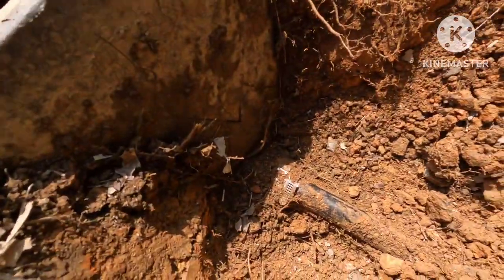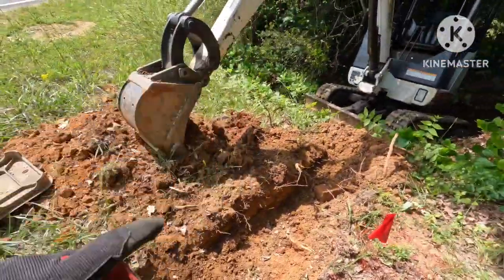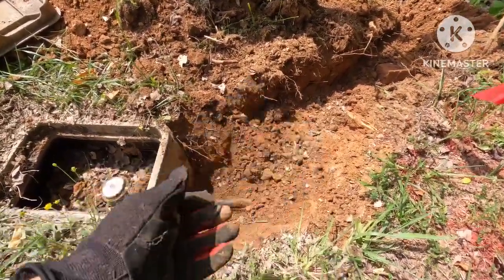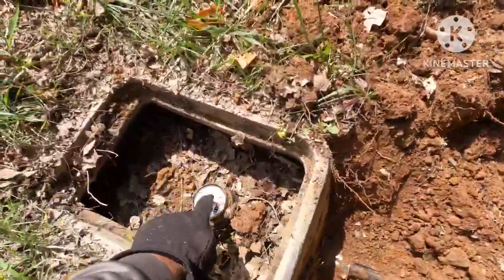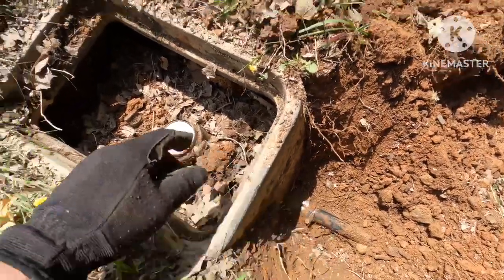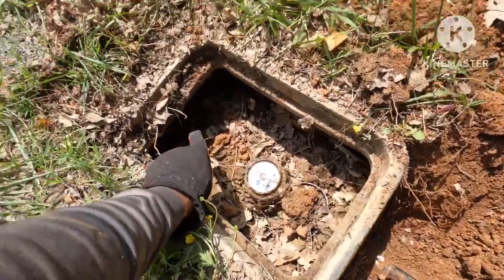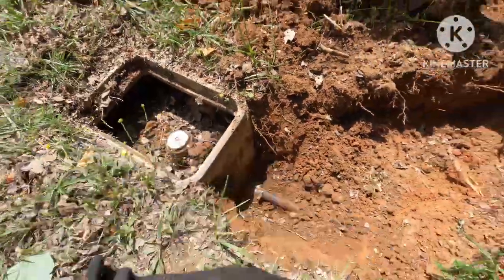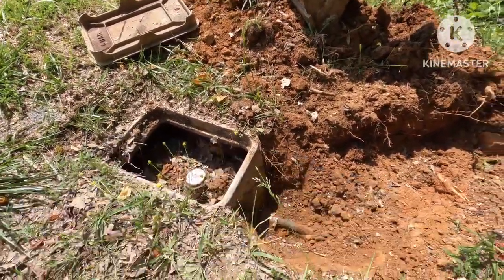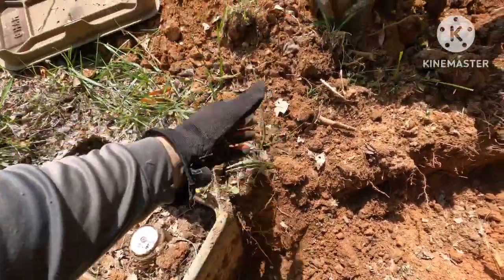This is called black roll — three-quarter black roll. Never start digging around this box with a machine until you locate this water line. You can cut it loose, but you don't want to grab it with your bucket and rip this meter out. If you grab this water line it'll more likely break right here, but if it's strong enough you can rip this meter from the city or county side, and you're having a bad day because you won't have the tools to shut that water off. So always cut this loose first and then you can use the machine a little to dig it away.